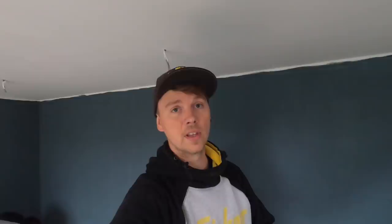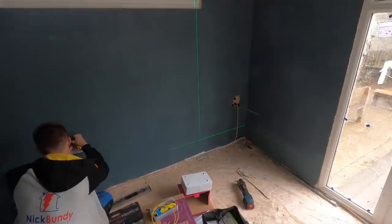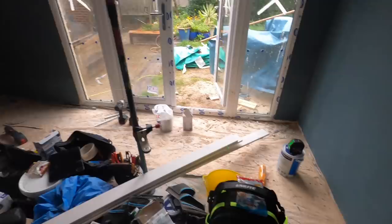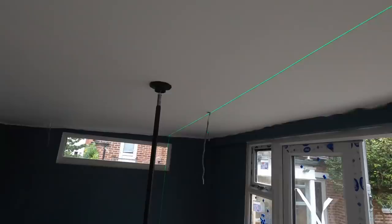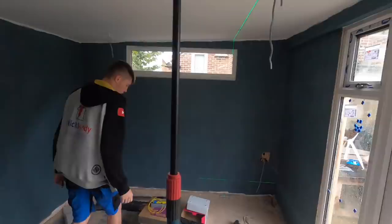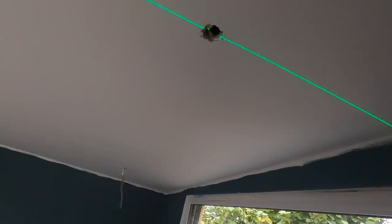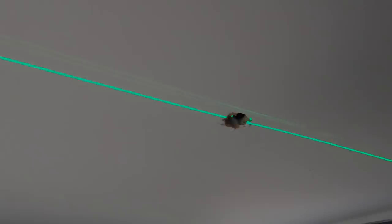So we've had the laser round, marked boxes. Adam's just doing a bank of four. I've unscrewed the bag off here, got all the bits off it, marked at the back of the board so that can all be glanded in and physically secured with the Copex and the armour to the back of the board. Put the banjo on — the banjo will earth the metal board and then I'll just do a fly lead as well. Now we need to figure out the mess that this person did by pulling all the cables out. I'm not going to have to get a hole saw on it, so I'm just going to physically put the hole saw in the ceiling, figure out the centre, mark around it, and then just pad saw it out, because obviously I can't get a pilot bit.